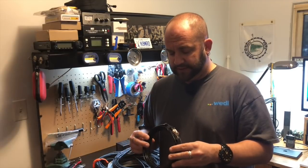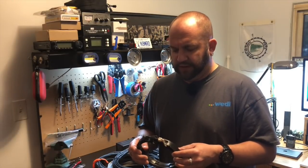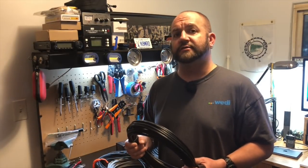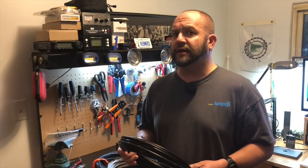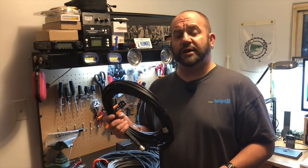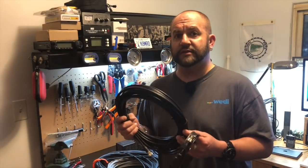What sparked this was I was building this roll-up J-pole antenna that I was hoping I could use on 2 meters and 70 centimeters. When I was testing it, it looked really, really good on the analyzer. The catch was I was using 50 feet of RG8X, and what looked really good on the analyzer was actually really terrible once I put a radio on it, because basically all my power was being lost, especially on 70 centimeters, in this coax. So I want to run through the different lengths of coax.